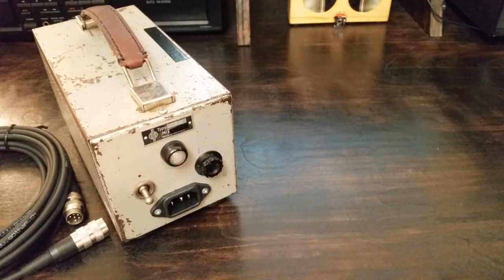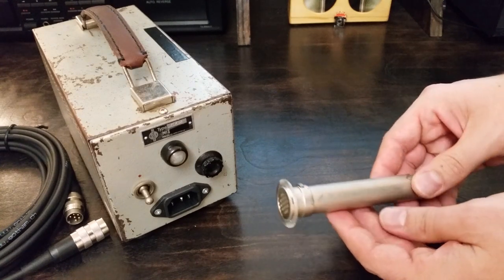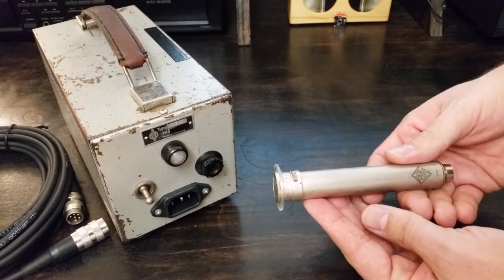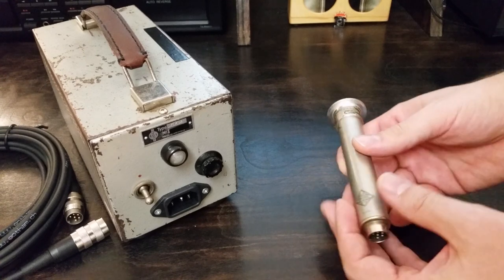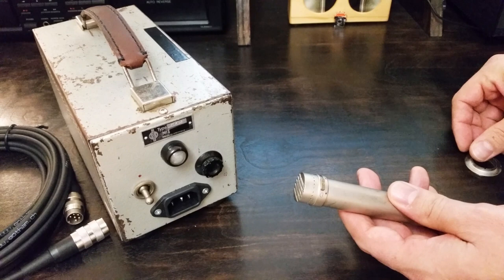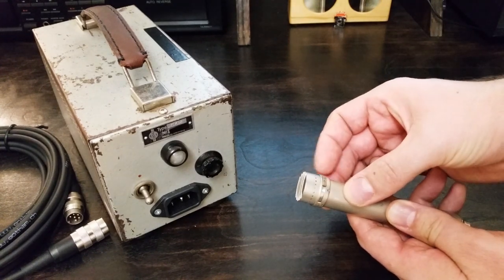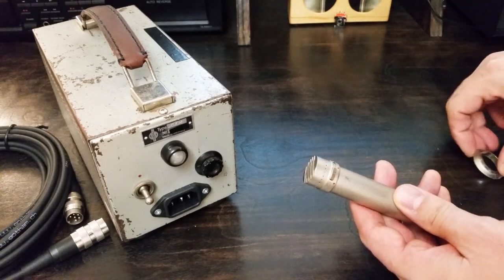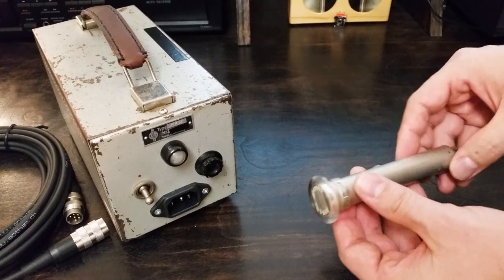This microphone body is packed pretty much with a tube, some resistors, capacitors, the skeleton, some wiring. It's really filled up in there. It's got a 6-pin adapter on the back for a cable. A little phase ring, we'll talk a little bit more about later. This sliding switch sets the capsule between cardioid and omnidirectional pattern. And pretty clean.